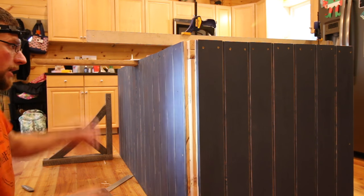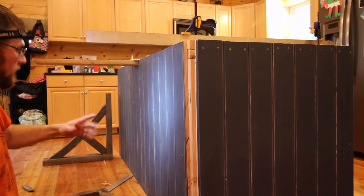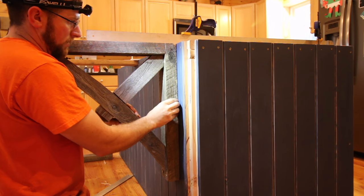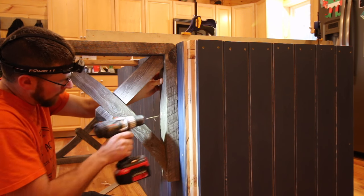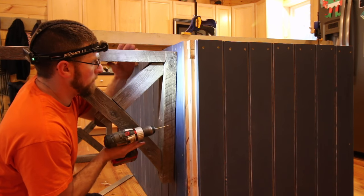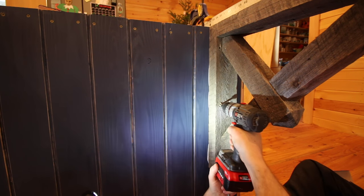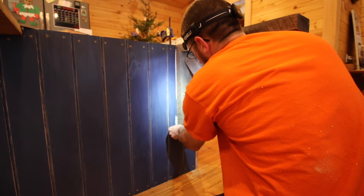I used my straight edge and ran a nice straight line down the edge of my board — marking how far away from the edge I want my corbel. I've got a straight edge running here so I can know what to set my top up against and have it all nice and flush. I'm wearing my headlamp so I can see my pencil mark nice. I pre-drilled all the holes for the corbel. I guess we know we put enough construction adhesive on there.